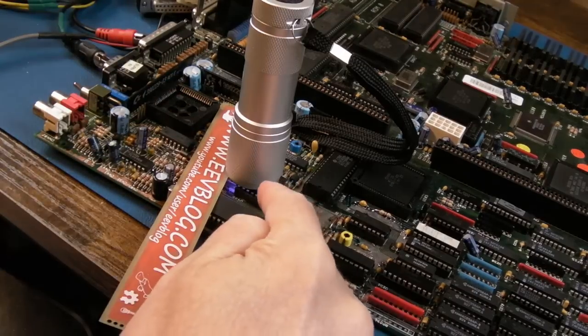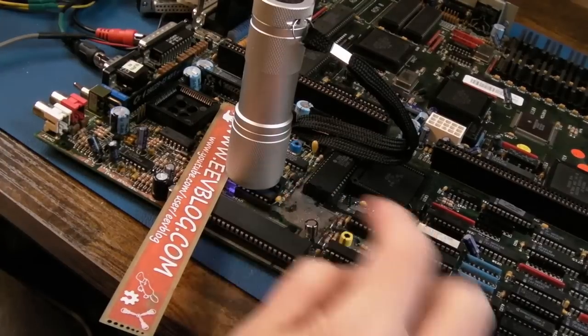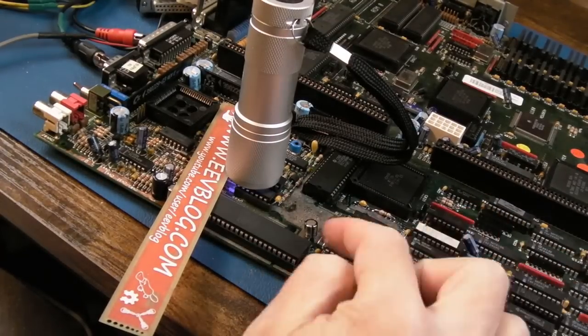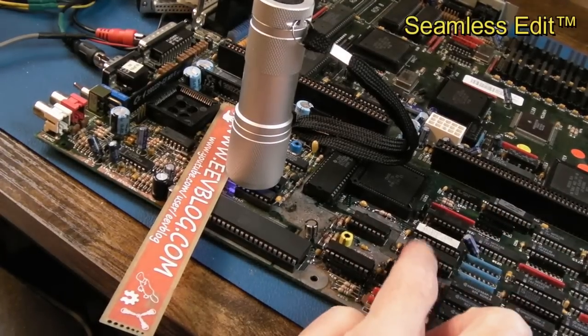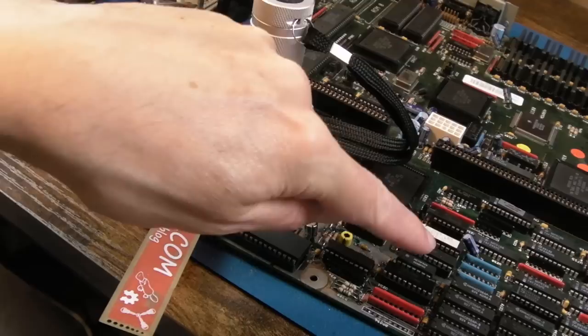I've ordered some new chips with longer legs to replace one or two of these chips, I think both those chips there actually, and this one, because when they've got short legs, you can see that's suffering from chip creep. You don't use it for 24 hours and it slides out slightly on one side, and whilst it still works, it's going to lead to reliability issues. So I'll just keep these as spares.